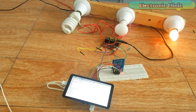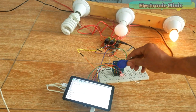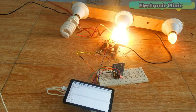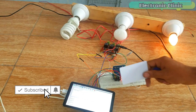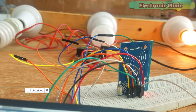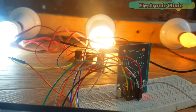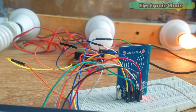In today's episode, you will learn how to make a home or office automation system using Raspberry Pi 3B+, MFRC 522 RFID reader, 5.5-inch OLED HDMI touch screen, RFID tags, and a 3-channel relay module. For demonstration purposes, I have connected 220V AC-lined bulbs, which you can replace with any other electrical loads you want to control using the RFID tags.